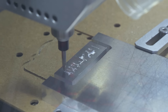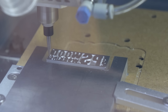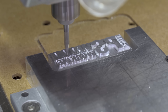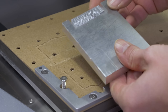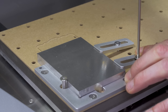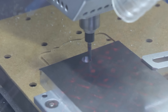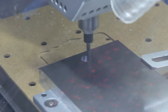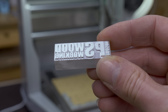I set the G-code to do the relief in two passes. Now I'm going to turn the piece and drill a hole for the handle. The result doesn't look bad at all, but there are some visible marks. I think I know why — I should have used the 3D contour function with the letters instead of the 3D relief. This way, the bit won't move horizontally; instead, it would follow the contour of each letter and would likely leave less marks.